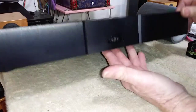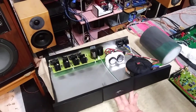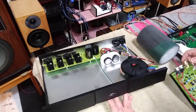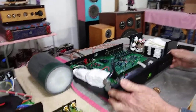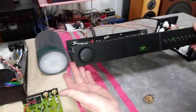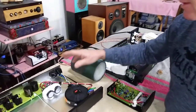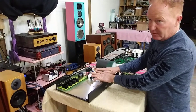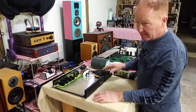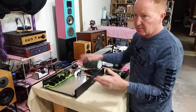In Naim Audio we've got a flat cap here — this is a power supply for Naim. Naim uses power supplies as a means of upgrading all this stuff, whether that be a phono stage like the Stage Line, or a pre-amplifier like this older brand new 122x pre-amplifier, and they have power amplifiers and so on. So Gilbert decided to add capacitance — 30,000 — to this flat cap, which comes with 20,000 from the factory. So it puts this at 50,000 microfarads of energy, which is 20,000 microfarads more than a high cap has inside of this, and this modification is a few hundred dollars.